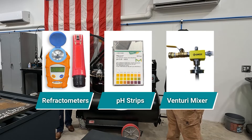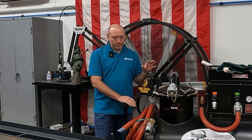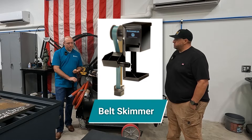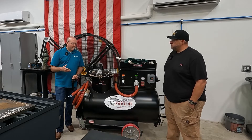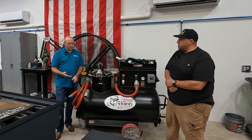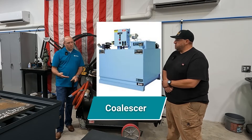And then you get into your coolant and fluid maintenance, which is your sump suckers. We talked about tramp oil and getting the contaminants out of the fluid. Things like belt skimmers are inexpensive and can help you get some of that tramp oil out. Your starting point is a belt skimmer, and then if you have more leaks and more effective tramp oil removal needed, you can get into a coalescer.